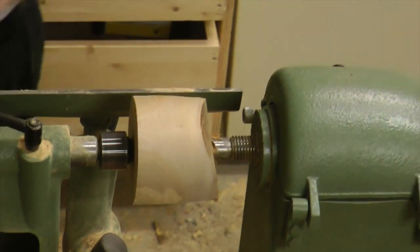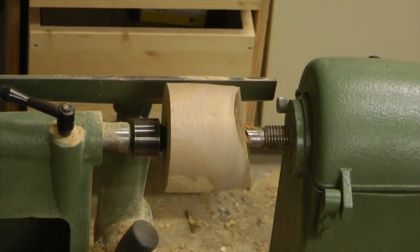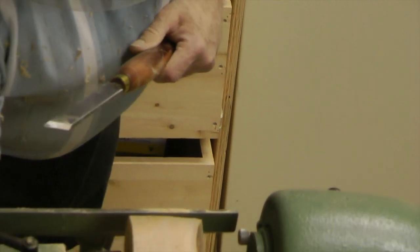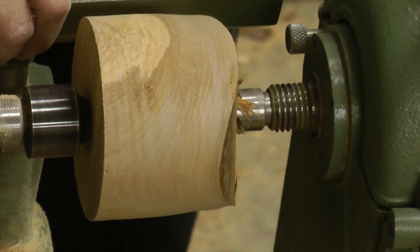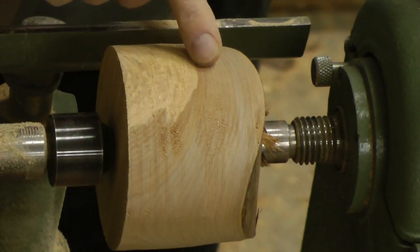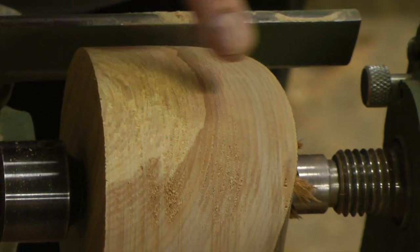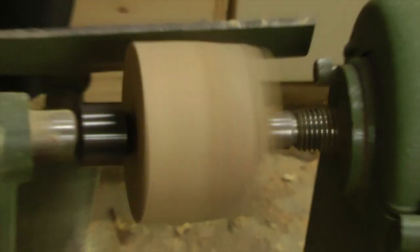We're going to smooth this out now with another chisel. This is a dangerous one. It's a skew chisel, S-K-E-W, and you make a heck of a mess or a real fine job. I hope you can see this, but get right down into it and you see it's nice and round, nice and smooth, but there's just some ridges in here. And that's what we want to try to get rid of, just the ridges to smooth it out. Back it off.